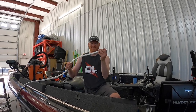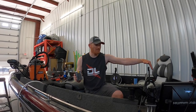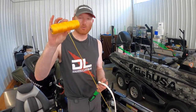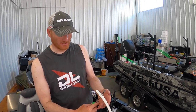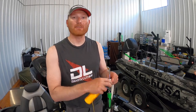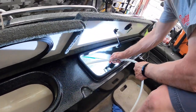What we're going to do is run some six-gauge duplex — that's the positive and the negative with six-gauge wire — up to the front, and then we're going to run a distribution panel with just our electronics on it so we keep nice clean power. That's going to run right back to the battery switch and a separate battery just for electronics. Heavy wire makes for a pain in the butt because this boat really wasn't designed for what we're doing. I like to leave an extra wire in the boat for future use or in case you mess up. One little trick with duplex wire: go back an inch or two, put a slit with a razor blade on both sides, then put something like a screwdriver in there so you can feed the wire through. Tie it off with a knot, put some electrical tape on it, and step it down a little so you have a smaller profile to get through that narrow opening.